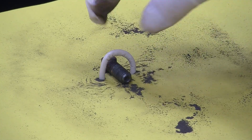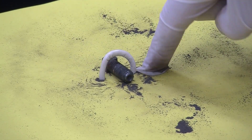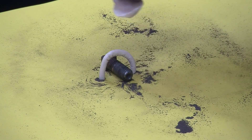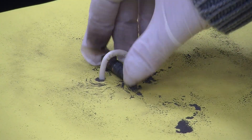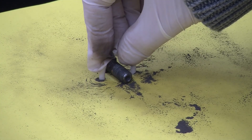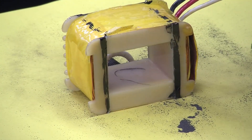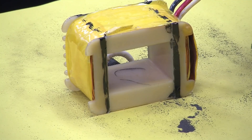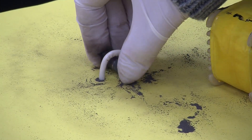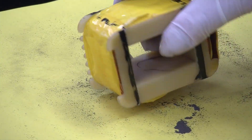So what we need is some way of getting 100 amps or more flowing around our core without actually having 100 amps of current flowing. And the way we do that is instead of using one loop, we use many loops — a few hundred, maybe 300. And in fact, that's how we make most electromagnets or things that use electromagnetism. Here is a typical coil — we've actually used this in our experiments before — that has about 300 turns on it, and those turns come out on these wires over here. But we should actually try and make an electromagnet with a few hundred turns of wire that we've created ourselves, just to prove there's nothing magic with this core.